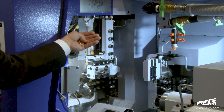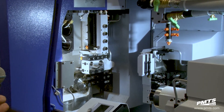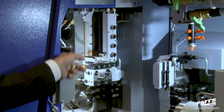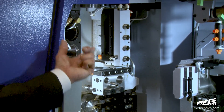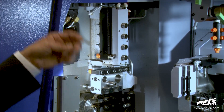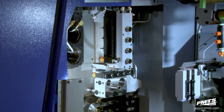The 45 degrees past 90 is what's going to be able to work on the back. This unit is cartridge type, so you can have the double whirling unit, pull that out, put a single whirling unit in, a face milling unit, gear hobbing, or all other sorts of holders.